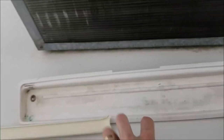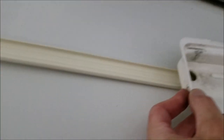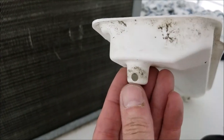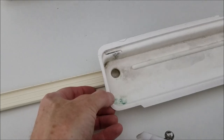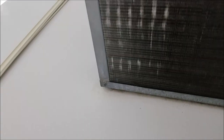My plan is with that drip pan and these little gutters - let me turn around and see how I made that little trough - it'll sit just like that so the water will drip out. See that little hole right there? That's where all your water comes out of, and if it ever got stopped up that could make for a mess inside your RV. So hopefully that's going to direct the water into the trough, and the trough will direct the water off the roof instead of running all over the place carrying the dirt onto the side of the paint.